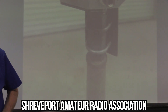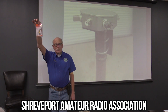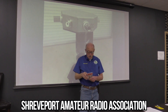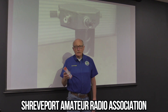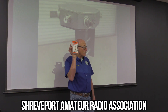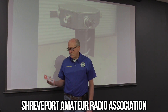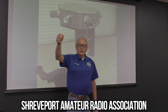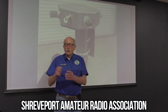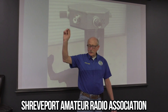There's nothing special you need to build these except one thing — a stepper bit. If you've got one of those big drill bit sets, you probably have all the bits you need. My drill would not take a half-inch bit, so I drilled a quarter-inch hole and used that to make my half-inch hole. It worked real good. I got this one at Harbor Freight for seven or eight bucks. This SO239 — you drill one big hole, it's a five-eighths inch hole, and you put a nut on there. If you use the standard flanged SO239, you'll never get all four of those holes lined up.